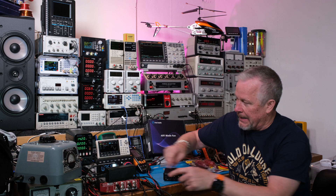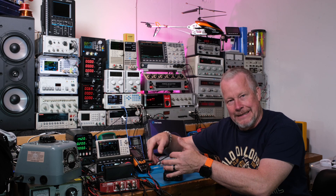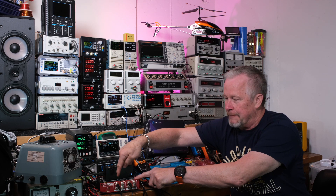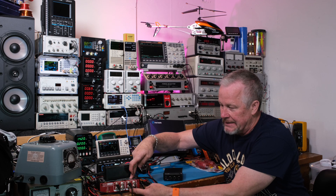I did check with the ohmmeter before tying my audio analyzer — once I tie my analyzer, there's actually a plus, minus differential input for both the input and output. It's kind of like using a scope with two probes across something without using the grounds, or tying grounds together. I have differential probes back here, so I'm used to using differential inputs, and I could have used one for both the input and output readings on this. But I was using alligator clips on one and thought that would be good enough.